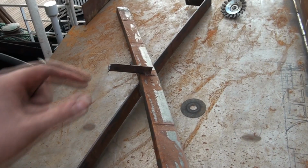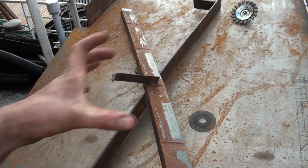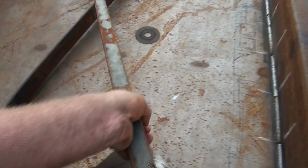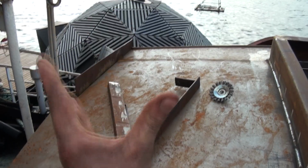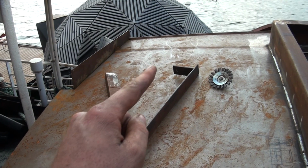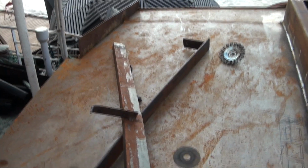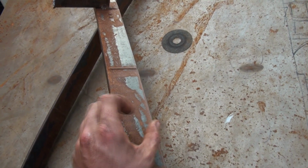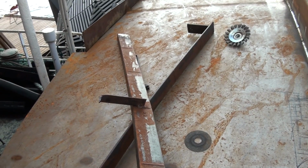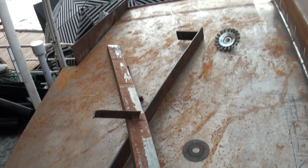I tried to bend it hydraulically, so having a hydraulic jack in the middle with a small frame to press it in 3 points. But the problem is, because it's only angle iron and not a T profile, an angle iron has a tendency to fall over. So then I ended up welding two of them back to back, so you basically create a T profile to bend it that way, but then you're pressing almost 60 by 12 millimeter with a hydraulic jack, and it wasn't really working that well. So then I ended up cutting all of them and welding them.